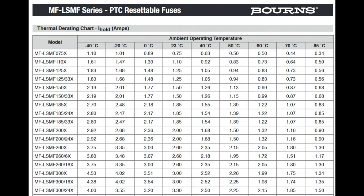You might have to pick a higher-rated fuse because you don't want the ambient heat to add to the Curie temperature and cause tripping earlier than expected. So if you normally would want a 2-amp fuse, maybe get a 3-amp because you're derating by 50%. Keep that in mind especially if you're doing robotics or LEDs with a power supply, where there's self-heating from the circuitry itself.